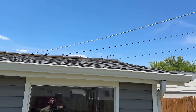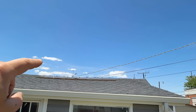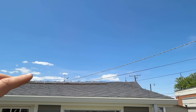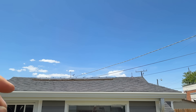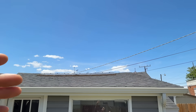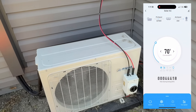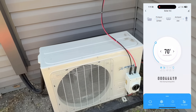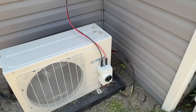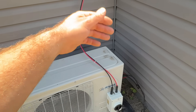For reference, I have seven solar panels up on the roof — temporary flexible panels, three on this side and four on the other, totaling seven at 200 watts each. You'll just have to do the math and see how long it will take to pay for itself depending on your area and sunlight. I'm currently running my Air Spool mini split on this solar array and right now at about one o'clock we're getting about 700 watts of energy. We're just going to take these terminals and route it around to our window unit to harness that same energy.